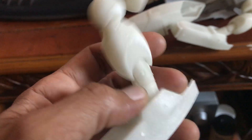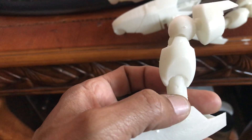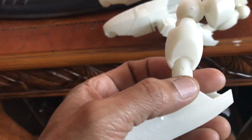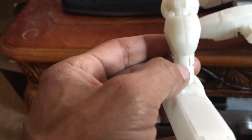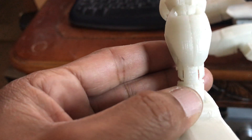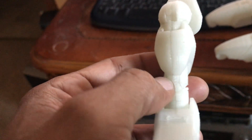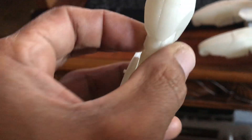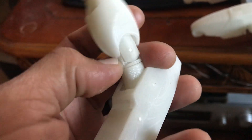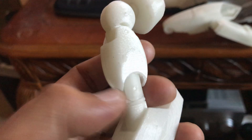Right now this is my big problem — it's flopping around. This might be fixable by putting in real metal pins. These are 2mm holes but this is 1.75mm filament, so it's probably just not stiff enough. Because it's forked like this, it's never really going to have enough pressure to just be a friction fit without making this much thicker, and it's still gonna flare out over time anyway.